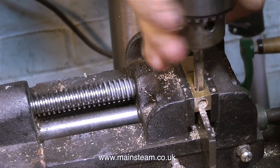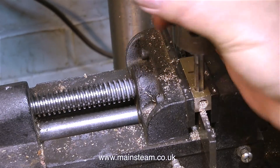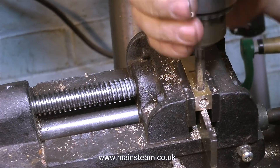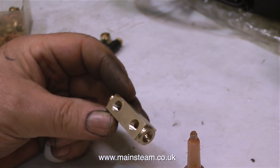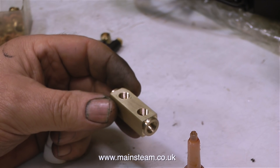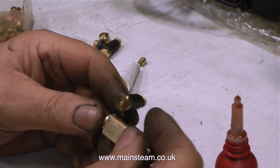I've already drilled a hole all the way through the brass block using the largest of my two lathes — the one with the four-jaw self-centring chuck fitted — ideal for quick drilling of square metal. The chronological order is quite important: first, drill the hole down the centre using the lathe; then drill the first cross hole, starting with the centre drill, followed by a tapping size drill for 5/16ths by 32, which is 9/32nds of an inch. Only when the first hole is threaded do I start the same process on the other hole. This makes for an accurate job — I don't want the check valves to be crooked.